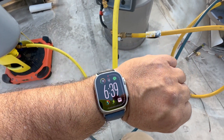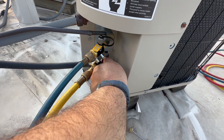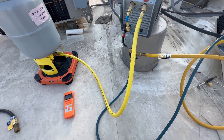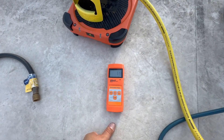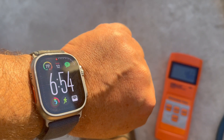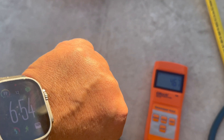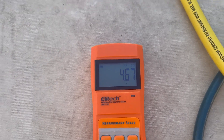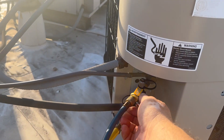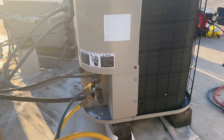After three or four minutes we turn on the vapor line so vapor goes in too. After three minutes it's already at 1.19 pounds. The previous method took 35 to 40 minutes — this is almost a third of the time. Now we turn it off and remove all our hoses. Thank you so much for watching; if you like the video please like and subscribe.